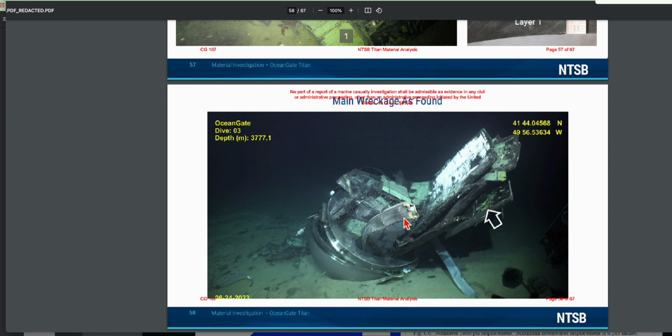Just hoop only. And here's the crazy thing, it's equal pressure everywhere. So you'd have to put an end cap on it, I guess, to do your modeling, some type of end cap. And I would say a very weak end cap if you're going to do it. Nothing to support. So just enough to keep the pressure at bay. So it's almost like you're just going to put an end cap internal to it.